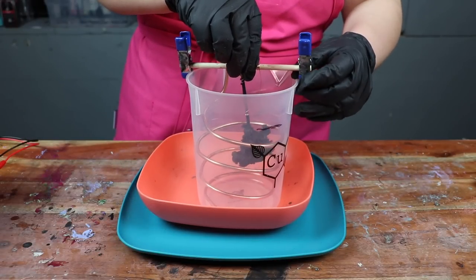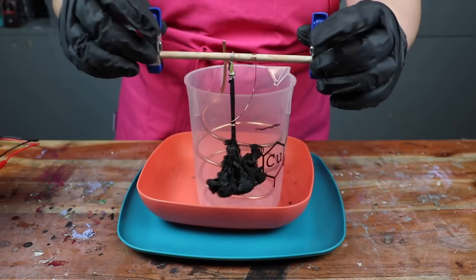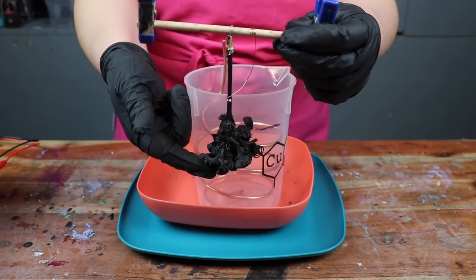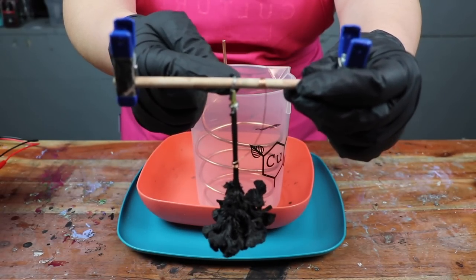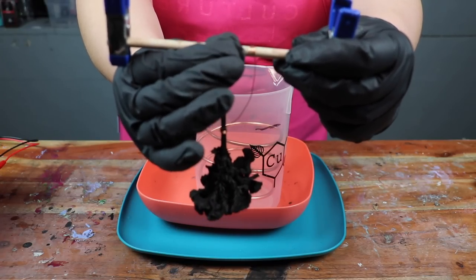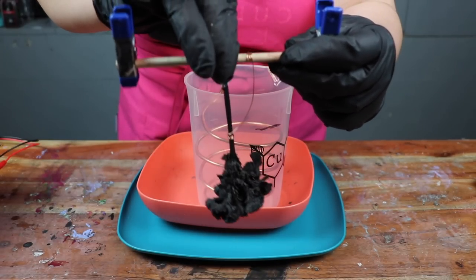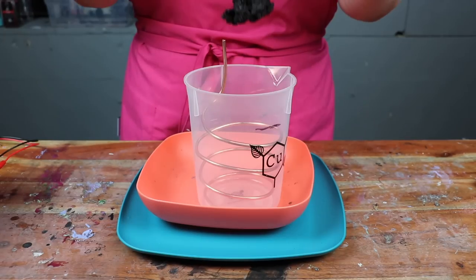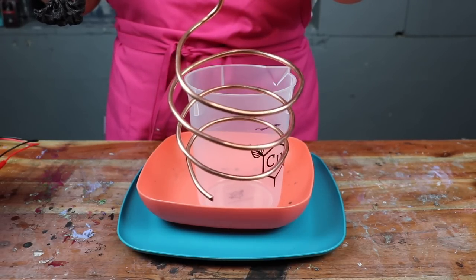It's going to work. Our setup is ready. Here's a crash course in electroforming and the setup for it. I have my bus bar, with some clippies that hold the bus bar on top of the cup. I have the thing that's going to be electroformed, which is the cathode. It's connected to the bus bar with some malleable, bendy wire — I really squish it onto the bus bar so that I can avoid having to use an anchor, because with organic stuff, it wants to float. This wire is copper, and that is the setup — 42 and a half total inches; 40 inches will be submerged and we have two and a half inches for the wire to connect to.